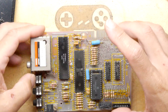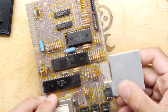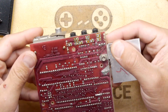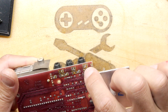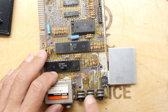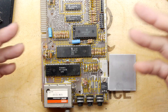Now let's check out the main board — you can see it's super simple. First you have your 5-volt regulator, the 7805, connected to a nice heatsink, and those are easy to replace if you find an issue. You can see 9 volts coming in going into regulation, though you'd have to check the circuitry to see if 9 volts is used elsewhere. You've also got the microphone connection and earphone connection — that's the input from your tape player to load games, and the mic out to record software onto tape.